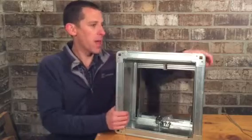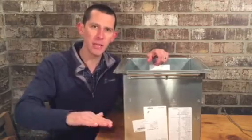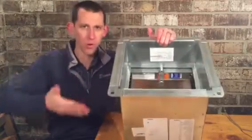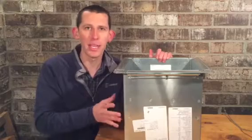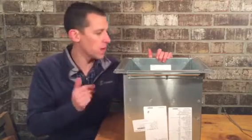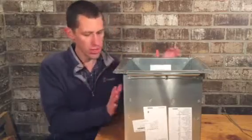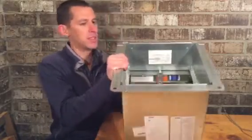All right, if we mount it floor to floor, so this would be horizontal. Horizontal versus vertical is the direction that the blade moves. So this would be a horizontal mount. The other way would be a vertical mount because the blade would go that way. Okay, so a horizontal mount has to have a spring even in a static system. So just because you see a spring, don't assume dynamic. Could be a horizontal mount. There should be stickers in the unit or on the outside or something that tells you which direction is up and what that's designed for.